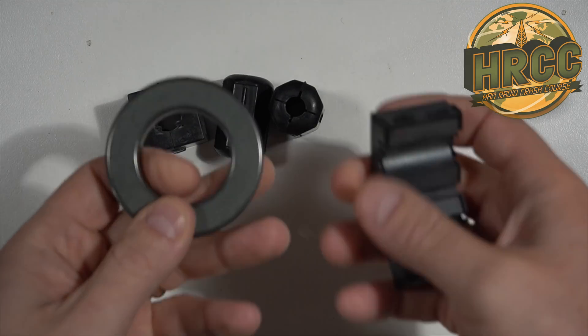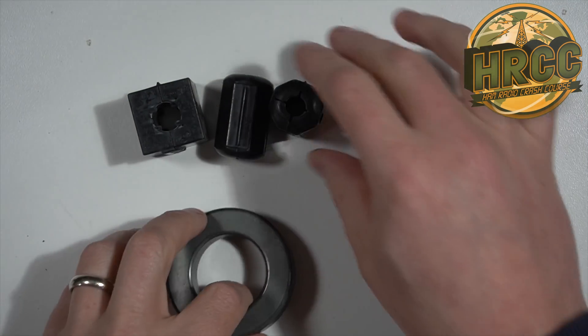But if you can't get rid of it, the next thing you need to do is attenuate that noise. The way I've been doing it is using toroid cores and snap-on ferrite beads. I'm not affiliated with Palomar Engineers, but I support their products. I've used them. They're not those tiny little ones you can buy on Amazon — they're big, beefy toroids and ferrites. They've been very effective in attenuating noise in different devices. Going back to my refrigerator, that is the noisiest thing I have, and you saw the noise floor from that one device peak way up.